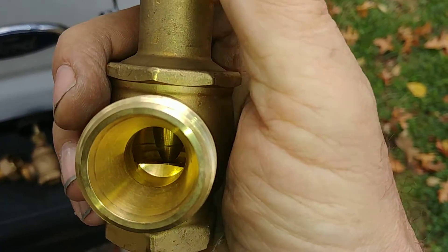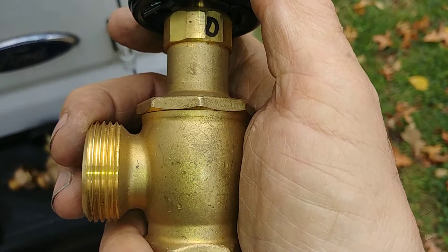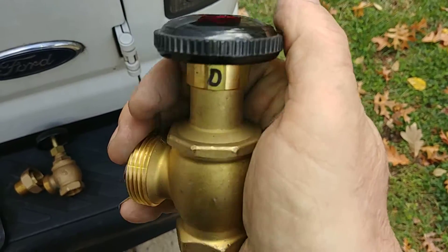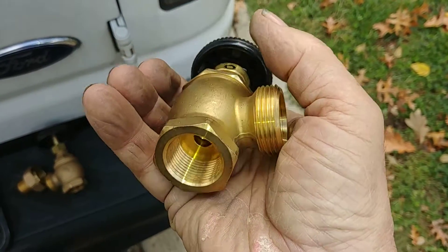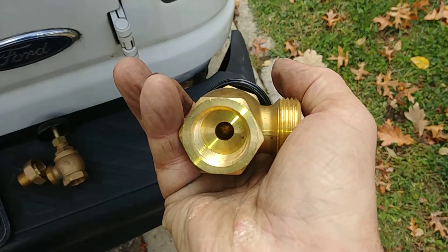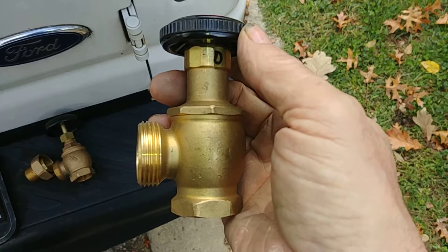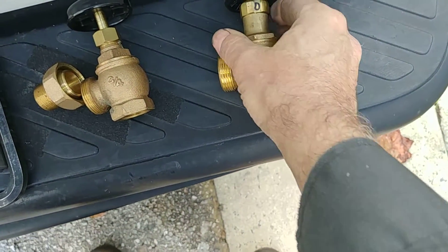Well, we're going to put a trap on there anyway. The radiator is small, we want it to heat fully, and because it's in a bathroom you want that bathroom nice and warm. So this is, we believe, the appropriate valve to put on an orifice-style vapor system. We're going to end it here, and again, I end with my profound thanks for your support and your questions. I hope this is helpful — let me know in the comments below, and stay safe.